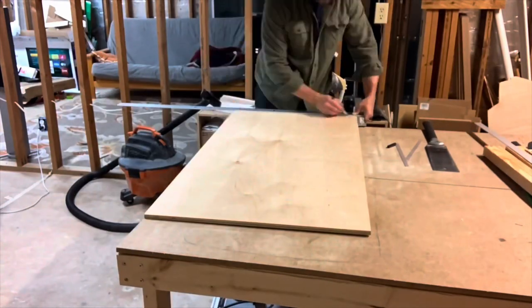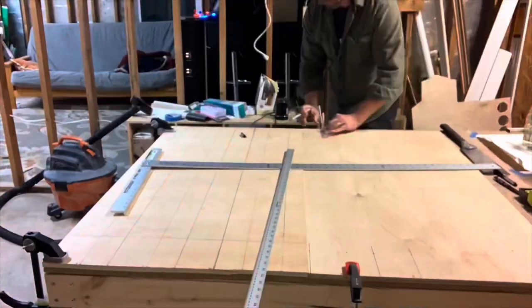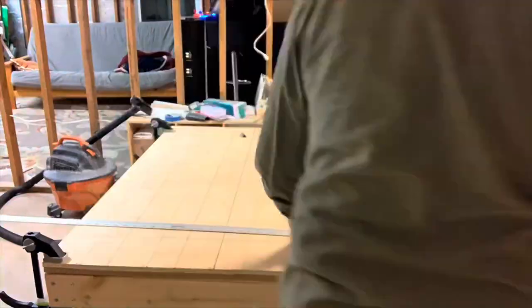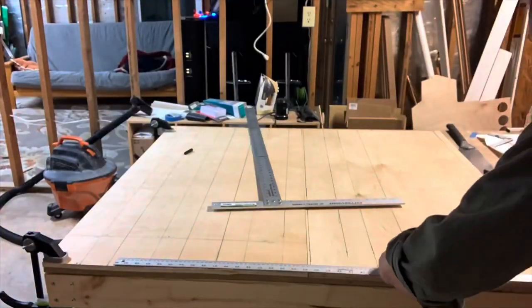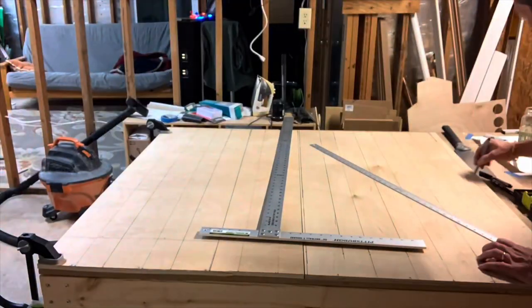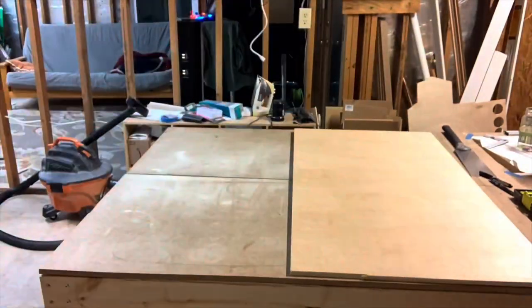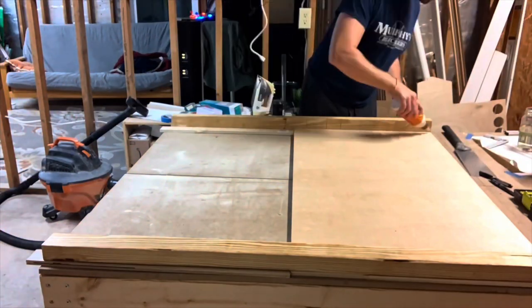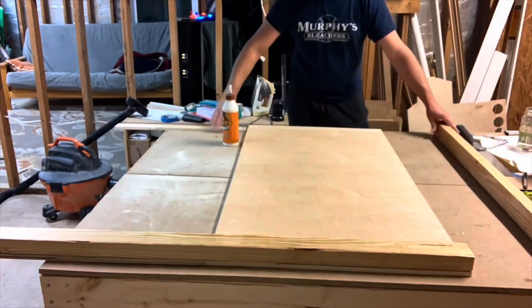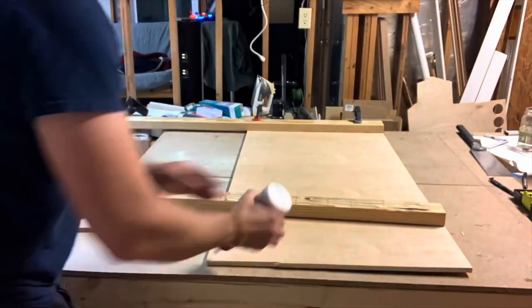I measured the board down to 47 inches wide. The shelves are going to be 46 inches high, which means I'm going to need two sheets of plywood. Once I had those sheets cut to the same width, I used my drywall T-square to draw the lines for where the boards were going to go. I glued the outer supports to the back of the board first — I'm going to come in with screws on the other side, but I wanted to give it a little bit of structure before I did anything else. The lines on the other side are going to show me where to screw for additional structure.